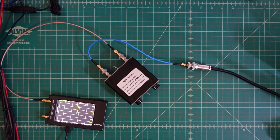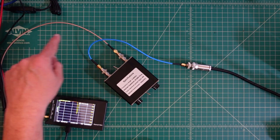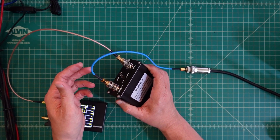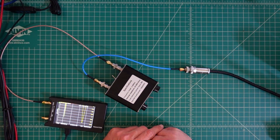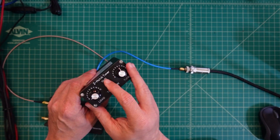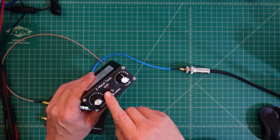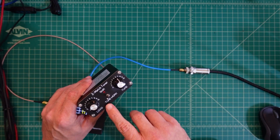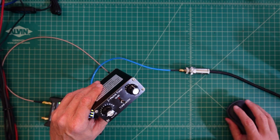We have a USB-C cable coming out of the computer going into the nanoVNA. Coming out of the S11 reflection port, coaxial cable runs to the tuner's radio input. On the back we have the impedance switch — we'll start on low as recommended. The antenna port connects out through a coaxial cable to a common mode choke and into my vertical antenna. On the front there's the tune/work switch; when tuning you want this in the tune setting and adjust for the LED to be as dim as possible. However, the nanoVNA puts out a very low signal like all antenna analyzers, so I believe we'll have to tune in the work setting.